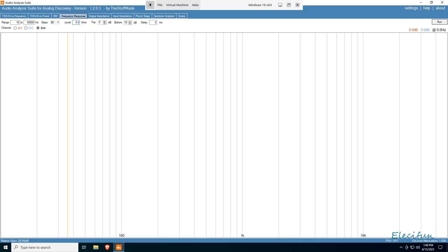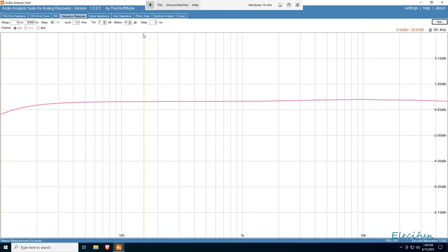A quick look at the frequency response — I'm putting a level in of about 0.4, channel one, and running that. Oh, what can I say — very nice! That's from 20 Hz all the way up, and there's even usable response from 10 Hz which we don't really need. From 30 Hz where we have decent audio range, the difference from there to the top is only 0.02 dB. At 20 Hz we're at minus 0.16 dB. Nothing really to report — that is very, very nice.